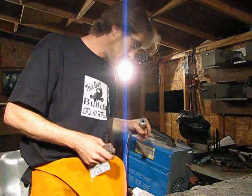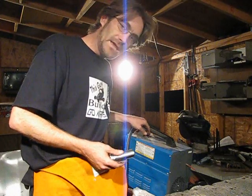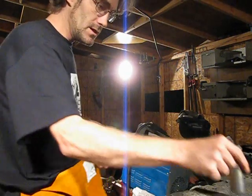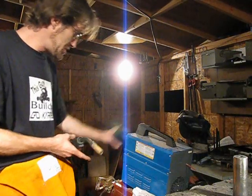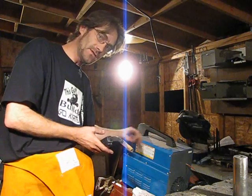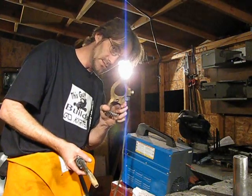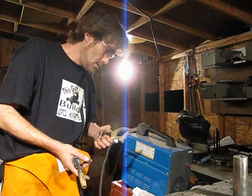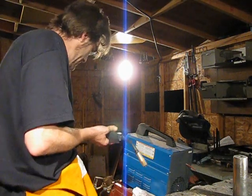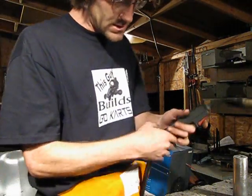Another thing — I was reading a post on DIY go-karts about these flux-core wire welders. In one of my previous videos I was talking about how the feed roller inside that feeds the wire through is where the current starts from. I was wrong on that. The voltage on the whole chassis and everything is all negative — the wire, the spool, the chassis, everything is all negative. The only positive is the clamp. On most welders the clamp is negative, but on these flux-core welders it's positive. The voltage actually starts here in the gun, not at the roller.